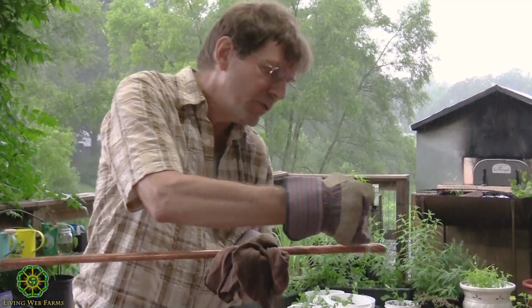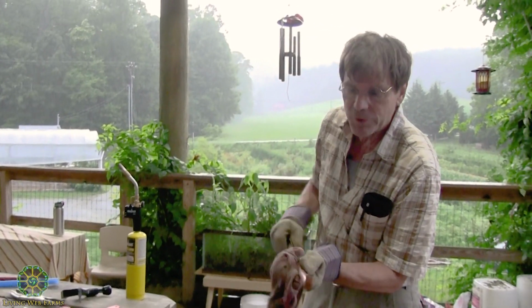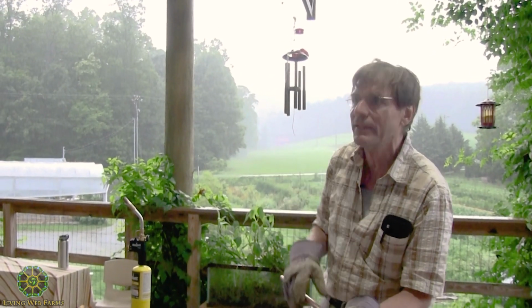And if it was boiling, you'll see little bumps. It won't be a nice smooth seal there. It'll be a bumpy one. And you'll see because it's gassed back out again and made a bump, and that'll definitely make it leak.